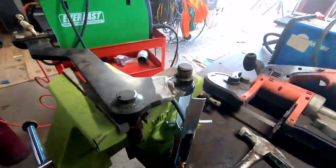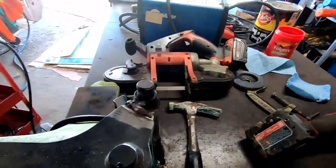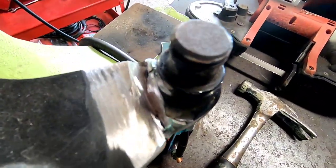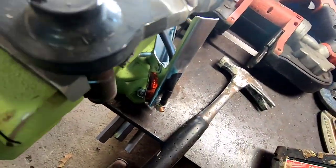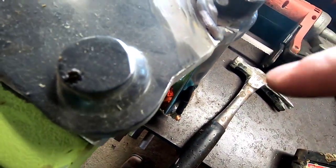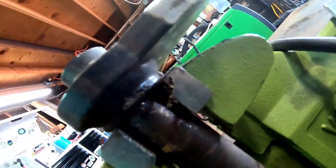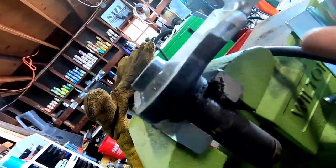This is how I like to address things that are broken off of pieces. I will tack it and then I will grind the crack away — I'll grind about halfway through, I will weld, and then I'll come back on the bottom once I flip it, and then I will grind all that out to my weld that I just put down on the other side. That way I know I have a good penetrating weld.